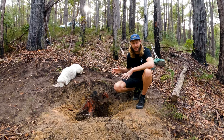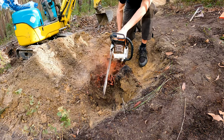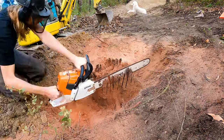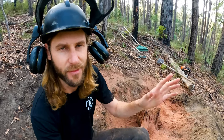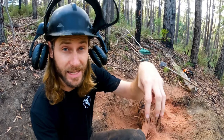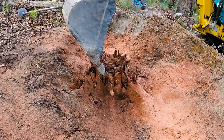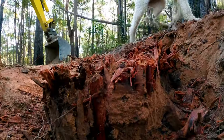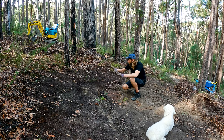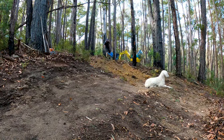The stump is bigger than I thought and it's too strong for my mini excavator. I'm going to grab my chainsaw and just hack away at this thing — I don't need to get the entire stump out, I just need to lower it a little bit. Dirty wood is terrible for chains, it blunts them really quickly. I use one of my oldest ones so it's fine — I'll sharpen it up and keep it for my dirty cuts. I've done a bunch of cross cuts and hopefully that weakens the stump enough that I can come along with the mini excavator and snap the top off in sections using the teeth. That should be low enough to bury. I also like to do some test runs so I know that I have the right line before I start piling up the dirt.